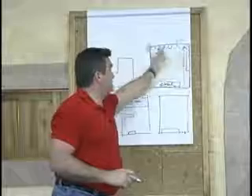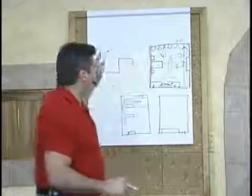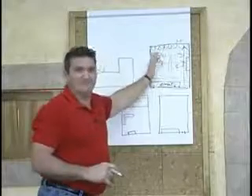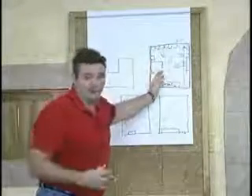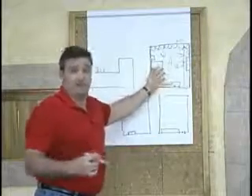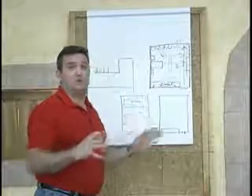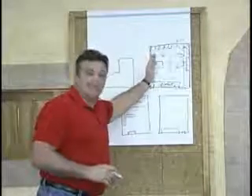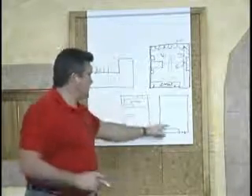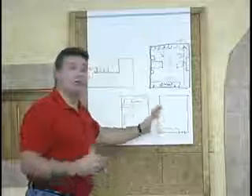Finish up that wall, trim, move your furniture back, and you're done with the room. We're not trying to do a full mill-approved stretch — you're satisfying your customer. Customers typically won't pay four hundred dollars per bedroom for a full furniture move and professional stretch. The national standard is seventy-five to a hundred and twenty-five dollars per room to take bubbles out, and the bear claws will do it successfully with the furniture in the room using this method.